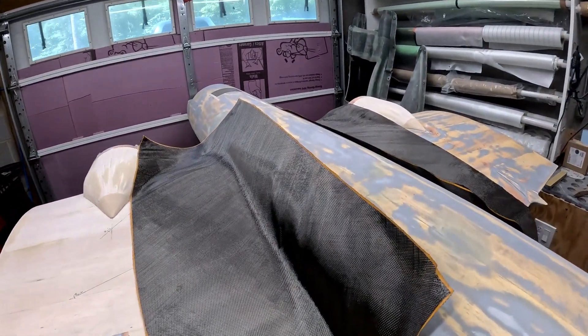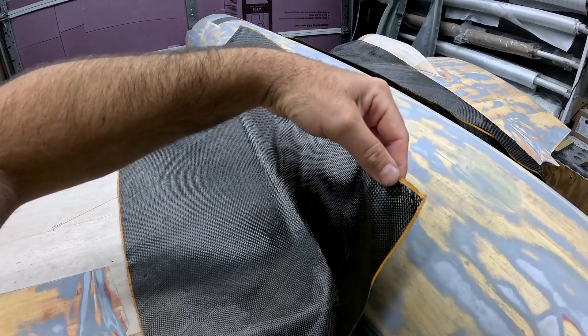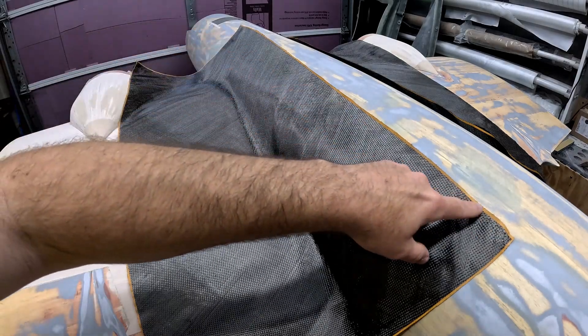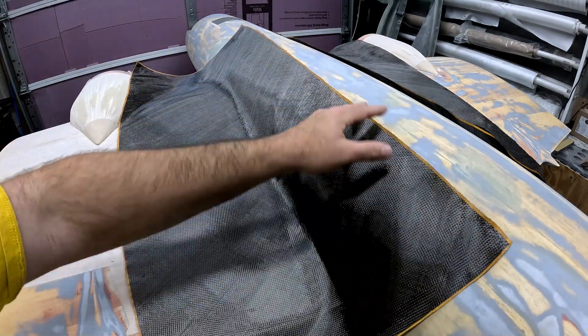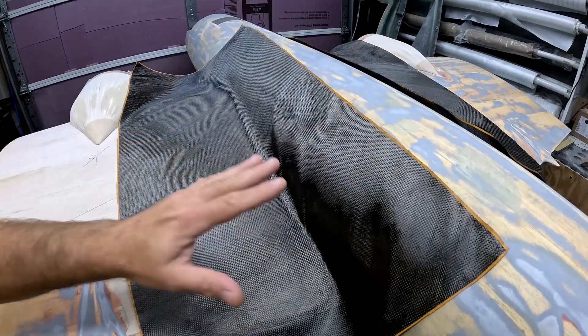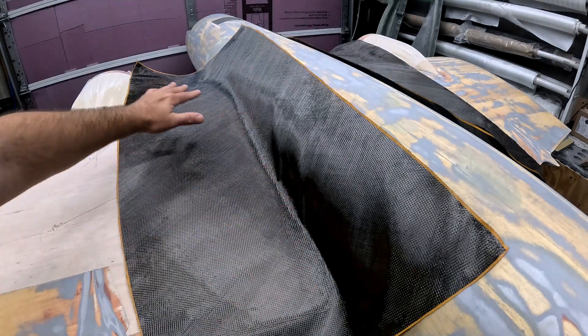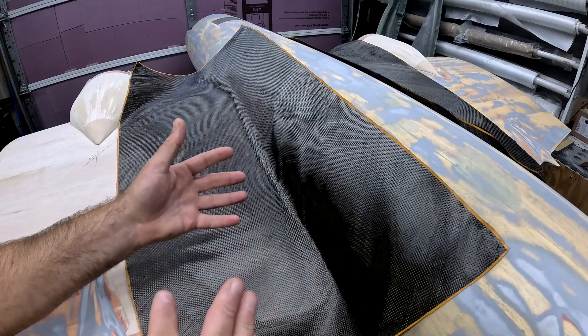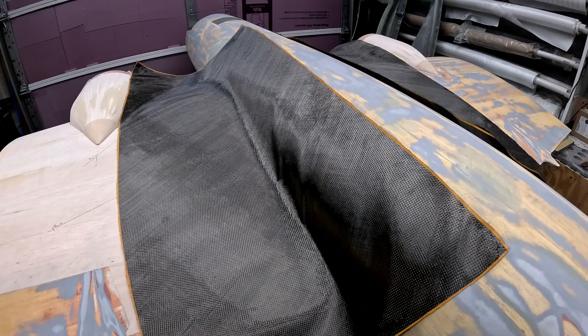One trick I do on carbon fiber, especially if you're going to cut it on the bias — which means the weave is at 45 degrees to the length of the part — I've got some orange masking tape around it. This works really well even on regular cuts with a 90-degree weave orientation. You just put the masking tape where you want to cut and cut down the middle of it. I use a very thin, about a quarter or three-eighths inch wide masking tape. Cutting down the center keeps the carbon fiber, fiberglass, or Kevlar from fraying on the edges. Then I'll put a good bit of epoxy on it to hold it in place, then cut the rest of the masking tape off so it's free to move and form however you need.